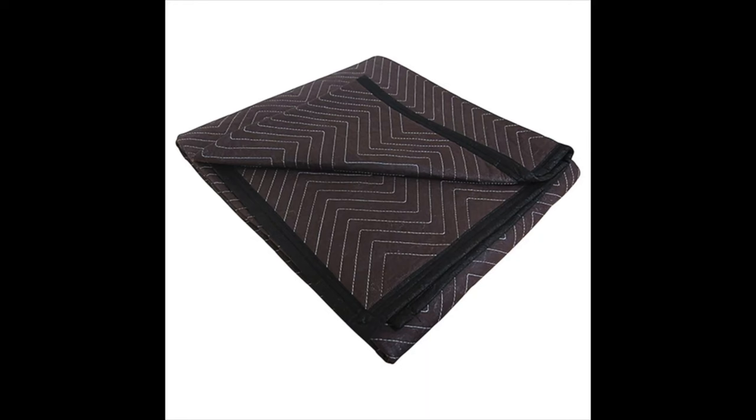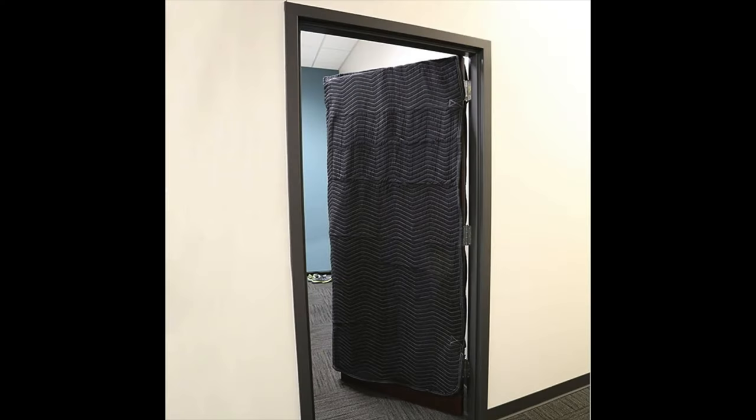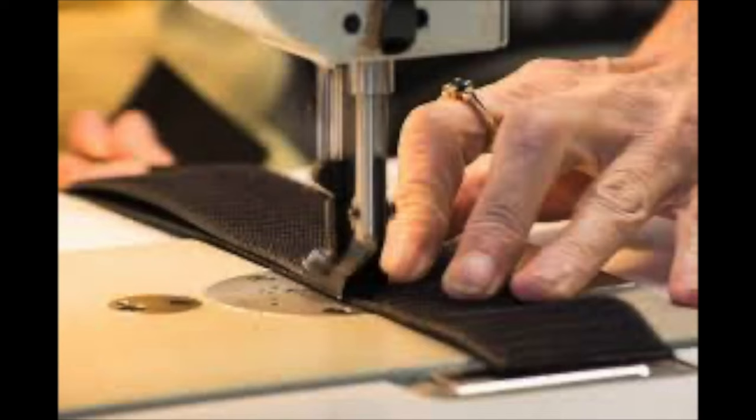The next three things are quite similar but differ in price. First are moving blankets. Adding moving blankets on the door will block some noise — they're much heavier and denser than regular blankets and only about $15 to $20 per blanket. I'd suggest sewing a strip of velcro onto the moving blanket and the other side onto the door frame, so when you close the door you can seal it up. That works a lot better than just hanging it over the door with a big gap all around.